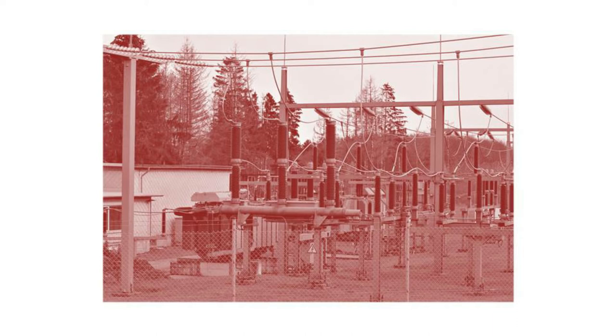The locations with which we put surge arrestors is to protect the valuable equipment. Surge arrestors are often installed on both sides of transformers, breakers, cap banks, reactors, and bus bars, etc. Surge arrestors would also likely be installed on the lines that are entering and exiting the substations.